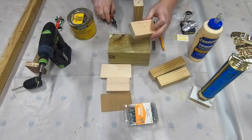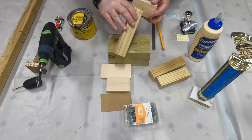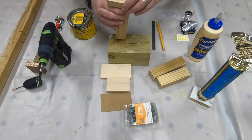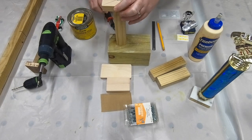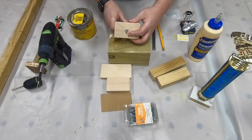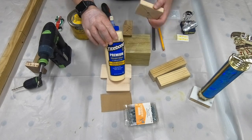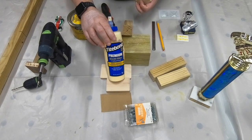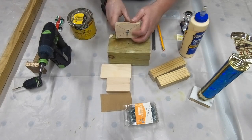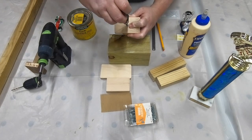The reason you want to make sure you do a pilot hole is so that you don't split your wood. Without a pilot hole it's going to be a lot harder to screw in, and a lot more likely that you'll end up cracking right through. Now, if you were actually doing this as your final step, I would add a little bit of wood glue right here on the base — or if you don't have wood glue, you can use regular white Elmer's glue — that'll just help things hold together a little bit better.